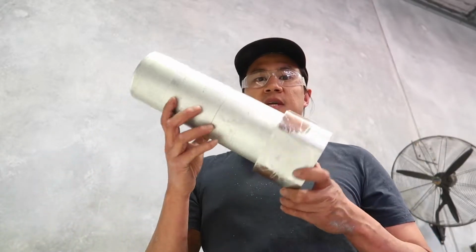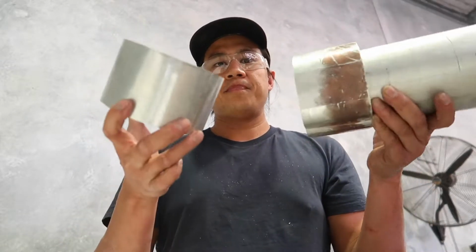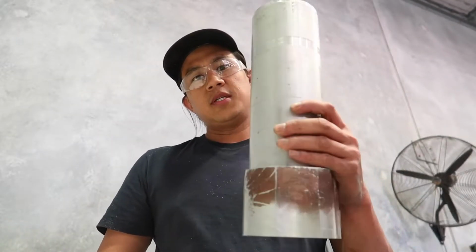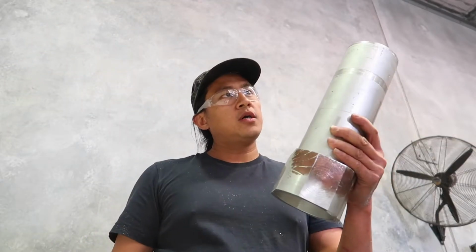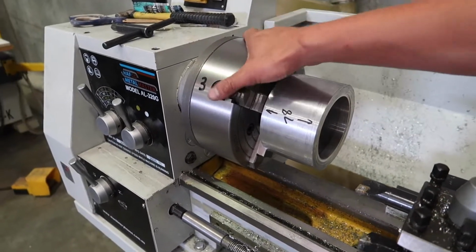Now that this fits into the rudder tube of Kulali, I just need to make this bearing block have the same profile as this, so this can fit in the top of the rudder tube. Then this will just get tolerance fit onto there in the boat. Then technically we should be able to put the rudder in and see what happens. We're going to make a 5mm step in here to accept the tube. Yeah, that's easy, so that's all lined. Good.